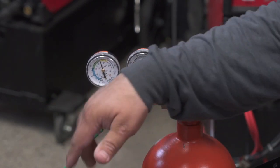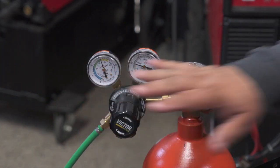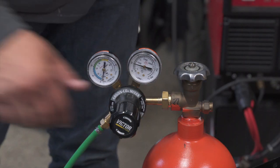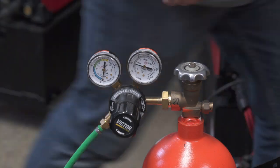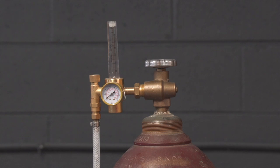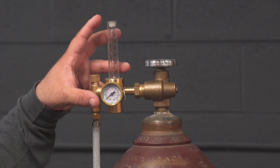When you're done at the end of the day, it's recommended to dial that regulator all the way back, then let the pressure out by pulling the gun trigger one more time, so as not to have load on the diaphragm. If you bought your Pro Pulse 220 MTS or Pro Pulse 200 in 2019 or before, you may have received this style of flow meter.